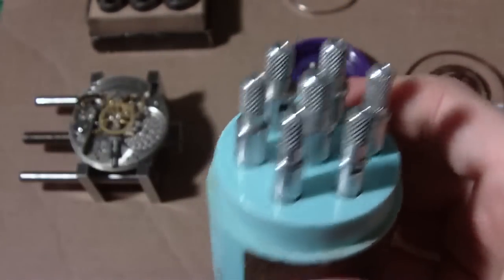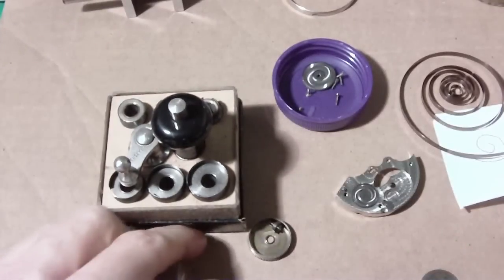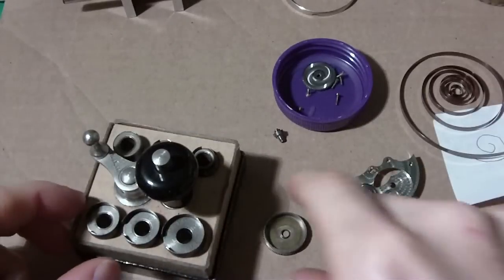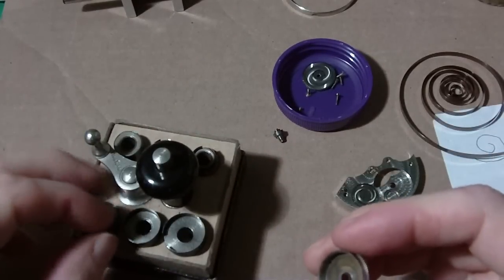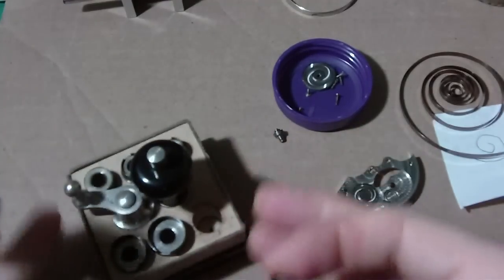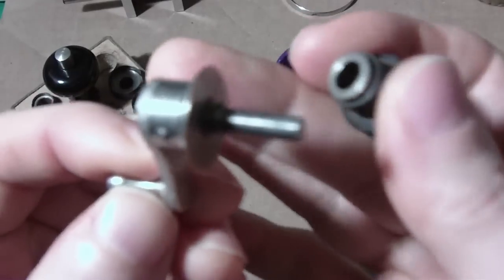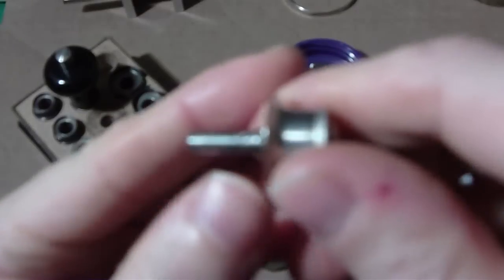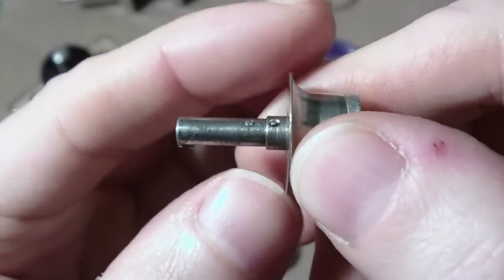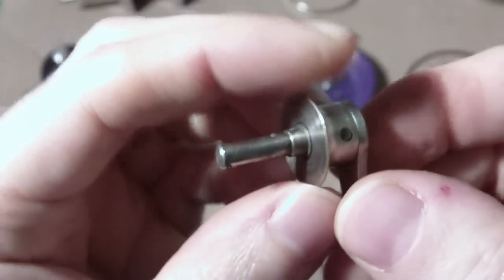I'm going to pick a winder that fits inside the barrel — the biggest one that fits in there. Looks like it takes the biggest winder. This thing's got little pins — two little pins for two different size mainsprings. The neat thing about this is if the pins ever snap off, which has happened to me, there are two holes in the back that you just push out some new material and you're ready to go.